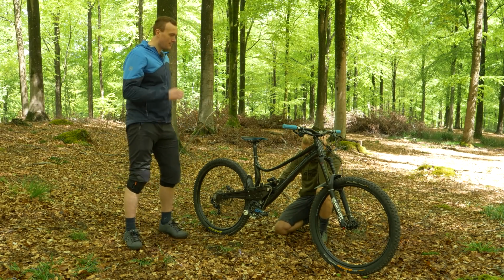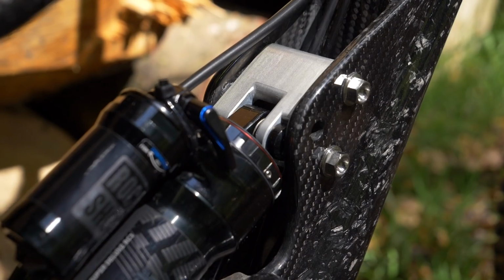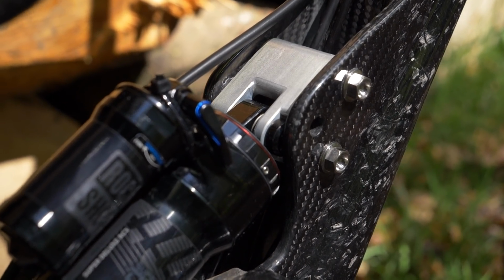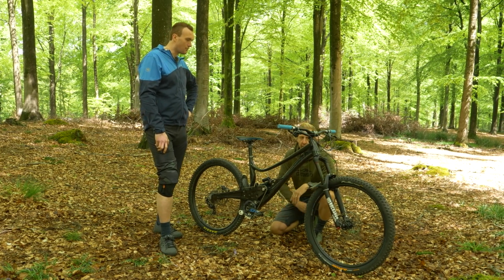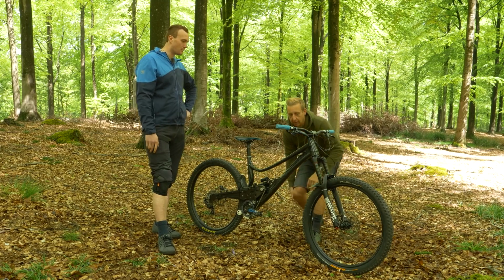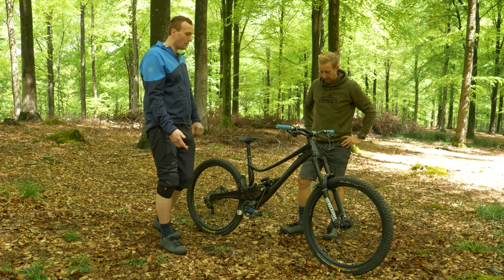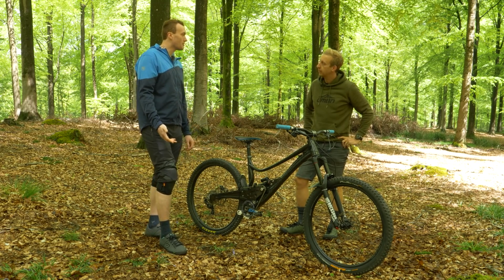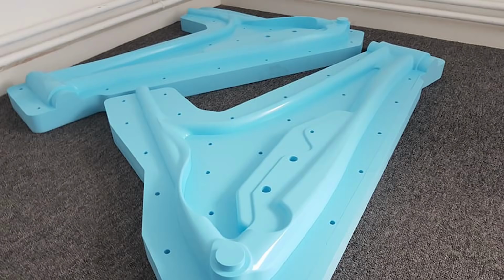Tell us about the process and how it works. How do you actually make a mould to make a bike like this? It's not like you just pop a frame together. It's not like working with metals. There are a few different ways. One of the ways is machining a tool out of aluminium or steel. In this case, I obviously had help from my workplace. They machined a tooling board, which is effectively a low-cost epoxy-based material. It's quick and easy.